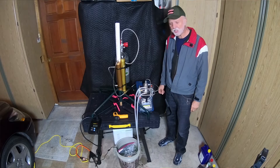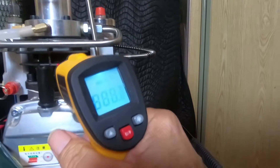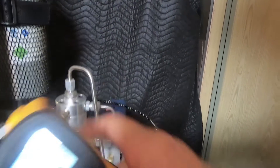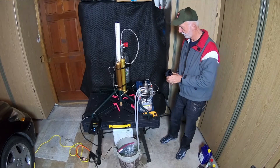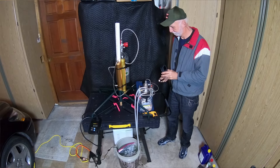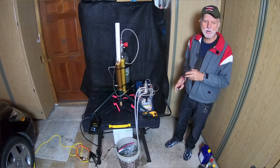The temperature is fifty degrees centigrade. Let's take a look at temperatures on the unit itself: fifty-eight degrees centigrade on the first stage of the piston, and sixty-two degrees centigrade as we exit the second stage — so it's pretty warm up there. Over here it reads fifty-one and a half degrees centigrade. Pressure is about four thousand PSI — I'd say that's pretty good.